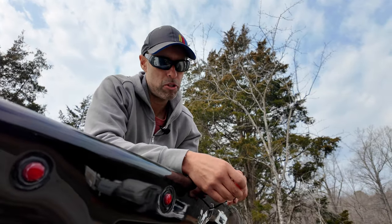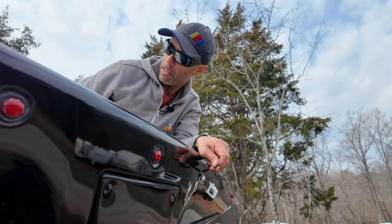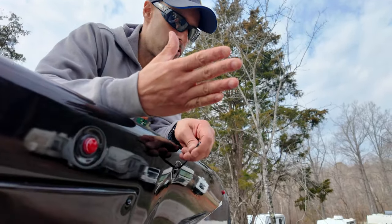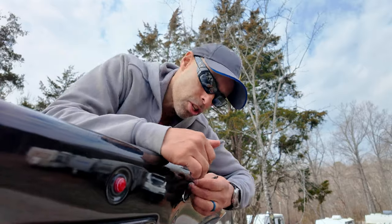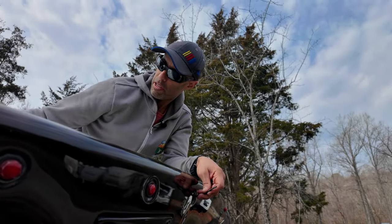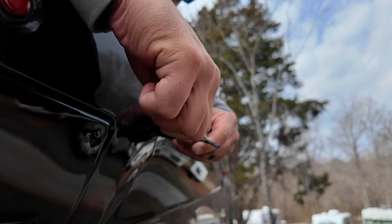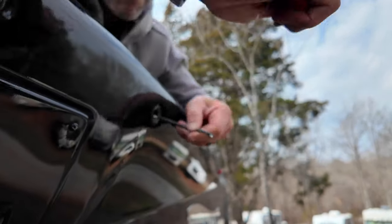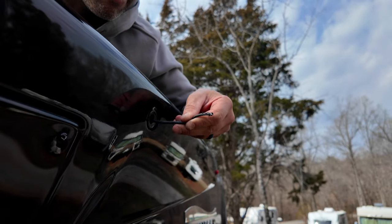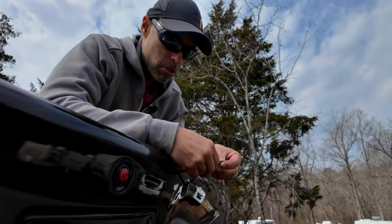First thing I'm just going to do is cut here with wire cutters. I'm actually going to reuse the rubber seal that's here — there's no need to take that off. I'm then going to use the dental tool — just get right in the middle here and cut the protective coating so I can get at those wires, then just peel back.